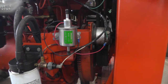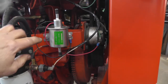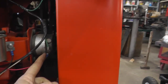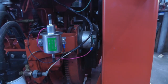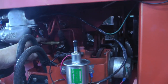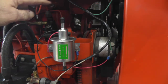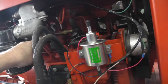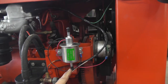Fuel pump's mounted. I just drilled and tapped a couple of quarter-inch holes in this plate — she's nice and solid. I put the ground wire underneath one screw over here, and the positive side goes over to this solenoid, so I didn't have to do any extra wiring. The next thing is to get the fuel line off the injection pump, which is right here. That's going to go to the top side of the pump, and the fuel from the filter will go down here to the inlet side.